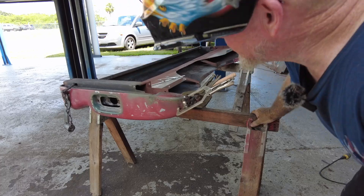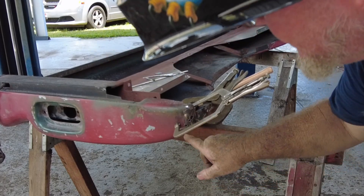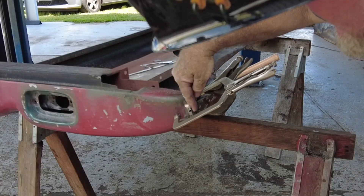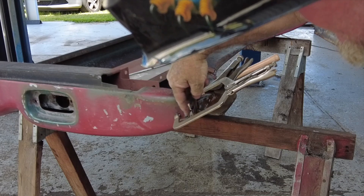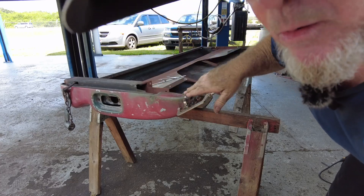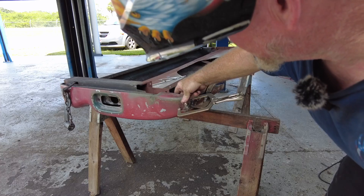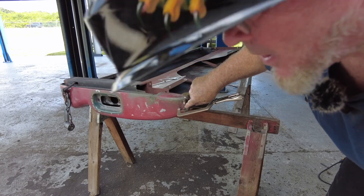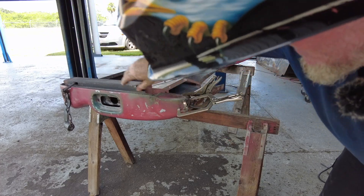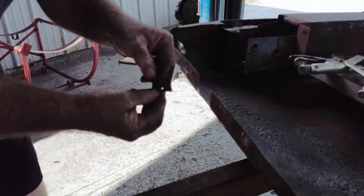This is a little bit hacked, but I don't want to fabricate the whole bottom corner. It's only got a few little soft spots — I put my grinder in them and ground them out to see how far they went before they got structurally strong. So I took a piece of metal, bent it to form inside the corner instead of making the whole piece beautiful — I'm using it as a fill so I can back-weld it, grind the welds down, and smooth everything out. No holes left, and if it's a little soft there's metal behind it. This is an alternative to replacing the whole back panel.